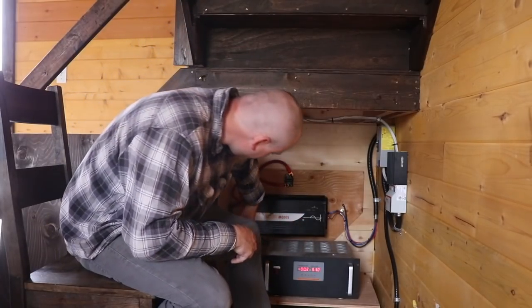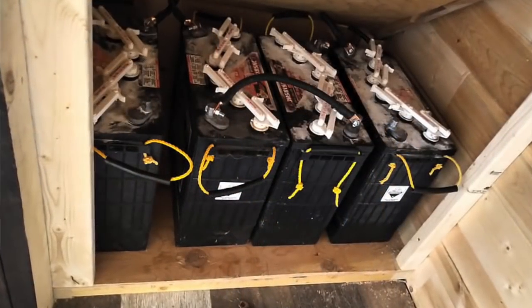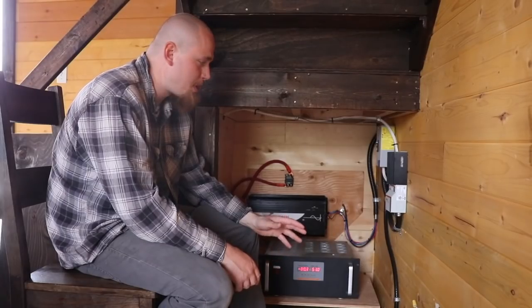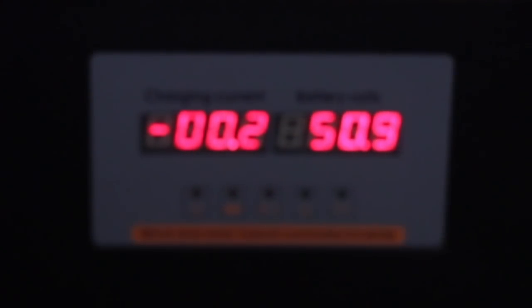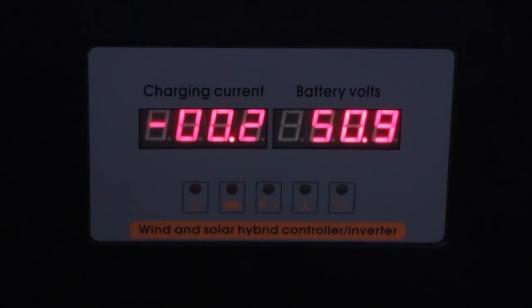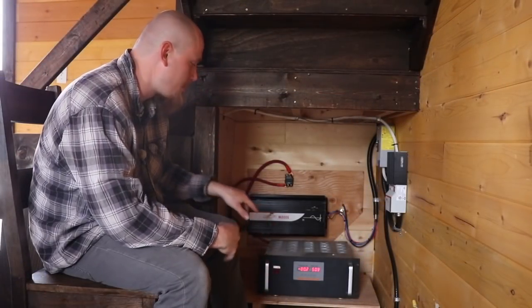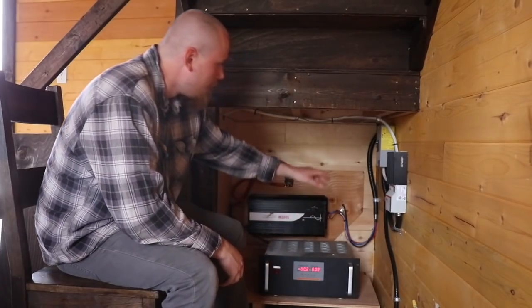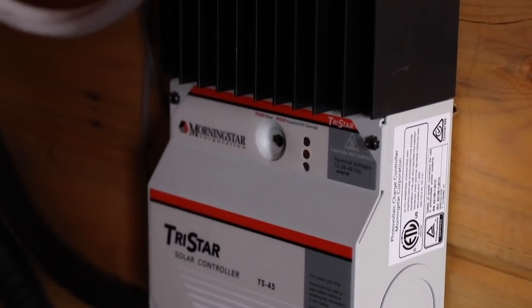This is under the staircase — this is where we house most of our components. In here is the vented enclosure for our battery bank, which is four 12-volt batteries wired up in series to make 48 volts. We have the Hummer charge controller, which only handles the wind power to charge the batteries. The TriStar PWM controller on the wall is in charge of the solar power to the battery bank.